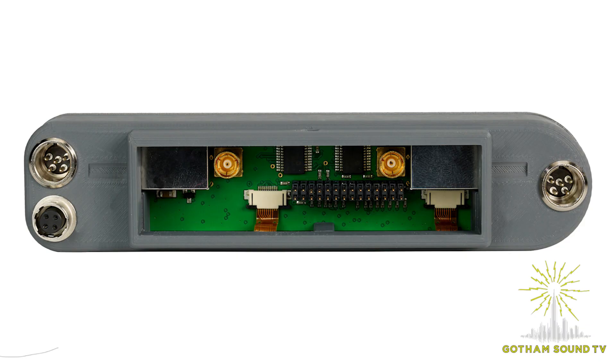These come in two different bands, just like the MRX414. Right now we're coming out with what we call the low version and the high version. The low version is the 500 megahertz range, the high version is 600. At some point we'll have a mid version as well. The mid version will probably be coming very shortly. The fact that the filters are in here was a big deal for us — we needed tunable filters the same way we have in all the other products. You can see some silver cans in there — that's where the filters are.